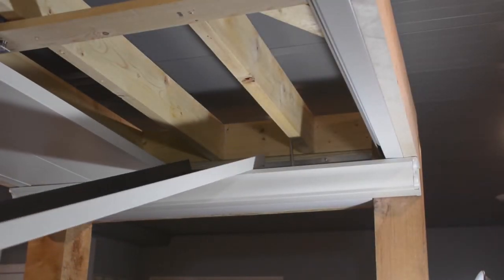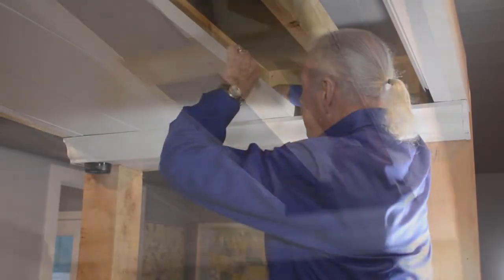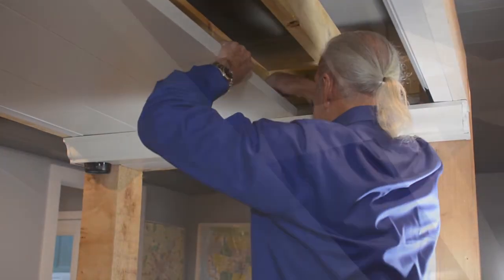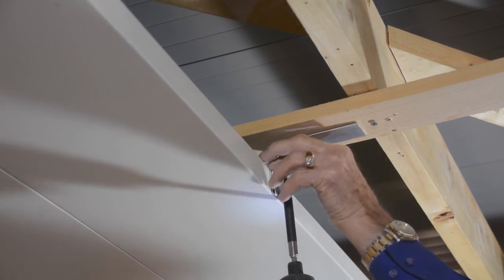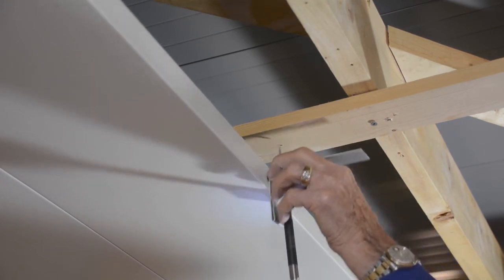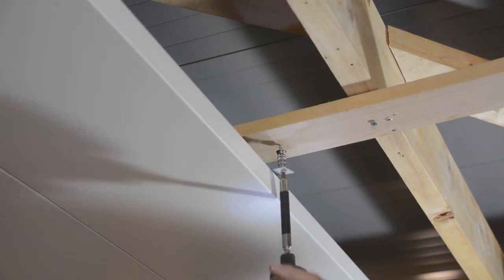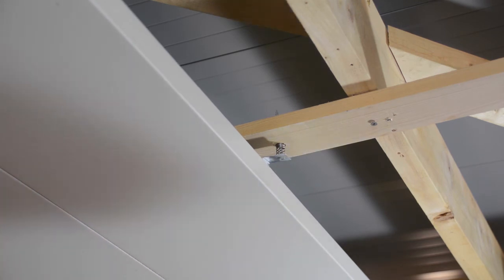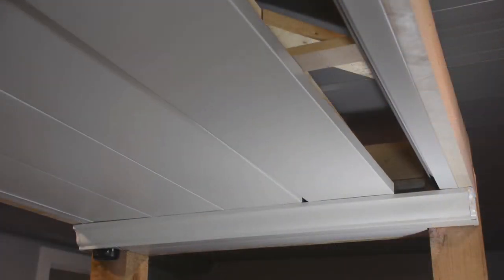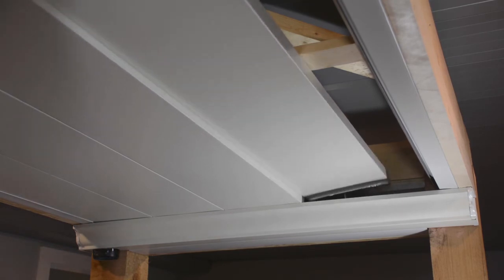Continue installing panels until 10 5/8 inches or less are left to the back of the wall channels. Our example at this point shows 2 full panels left. Continue with the long panel latches. Install this panel next to last, but do not lock it into the gutter.